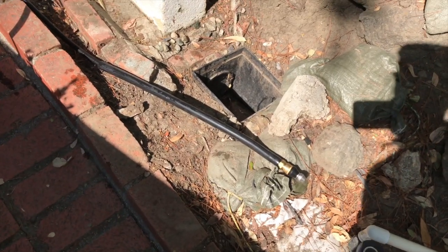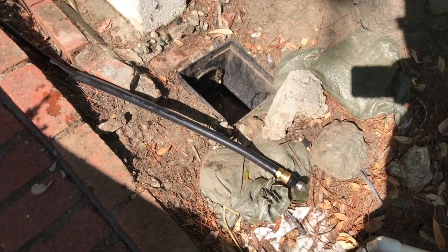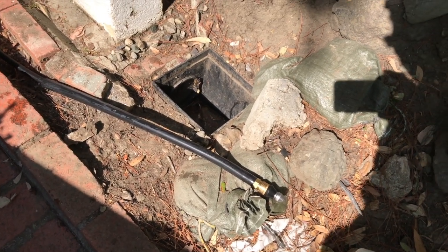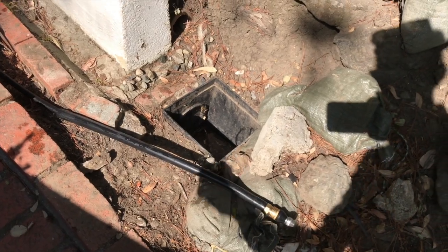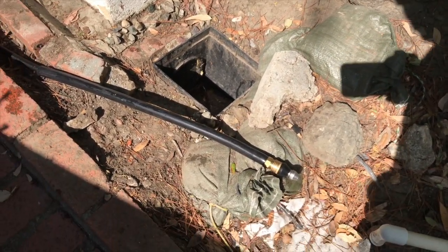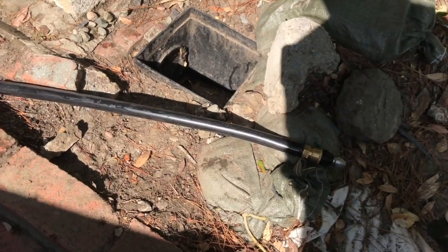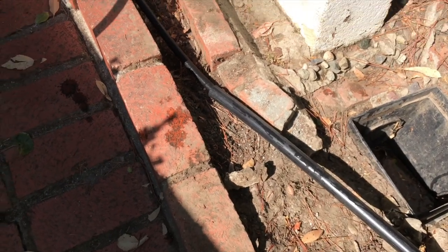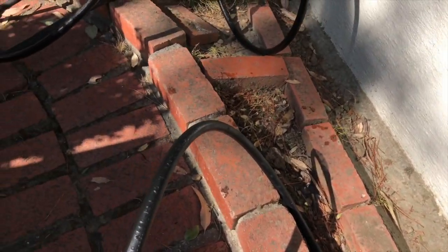It took me a while. I hit some blockage, but I kept working it, taking the hose back and forth in a scrubbing motion. Finally it punched through and extended a full 50 feet. When I pulled it back up, the hose is not muddy, so that indicates I cleared it out pretty good. However, I cleared out all the mud but I have roots, which is a real bummer — it means the pipe is breached. If I snake it out it's a temporary solution, but I have to do this before winter.